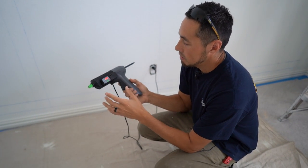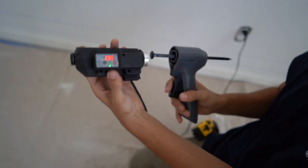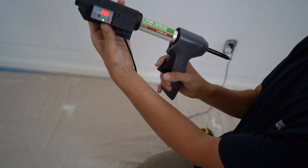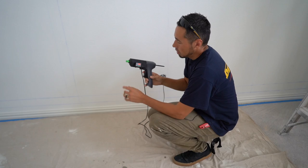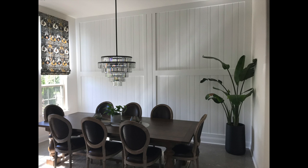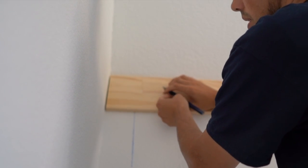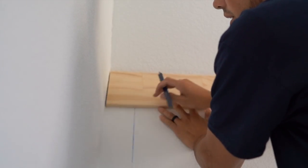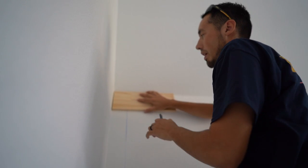Basically it's a corded gun — he has the cordless version. Inside of it there's a cartridge of polyurethane hot melt adhesive — wood to wood, 30-second set time. We're going to try to use this today. We tried it a little bit on the last accent wall where we did the vertical shiplap and had some success with it. So I've just cut this as a straight cut on the saw, and you can see we have a pretty substantial gap that tapers off to the bottom — about 3/16ths. I'll mark that angle on it and go cut this.